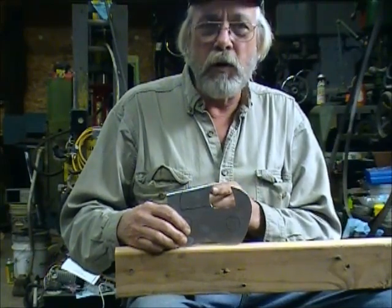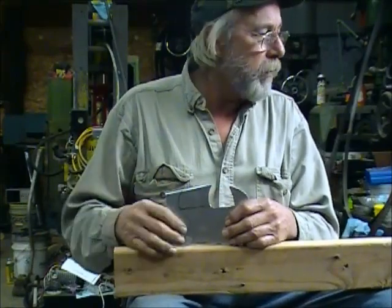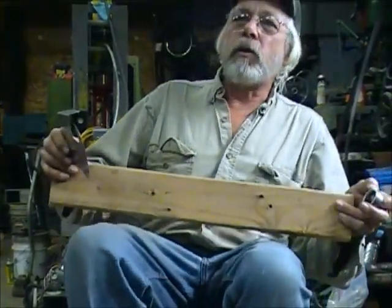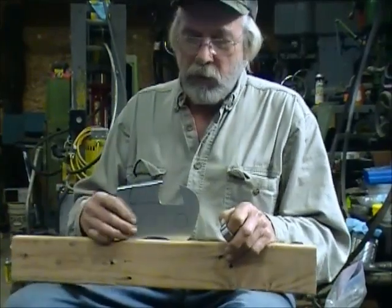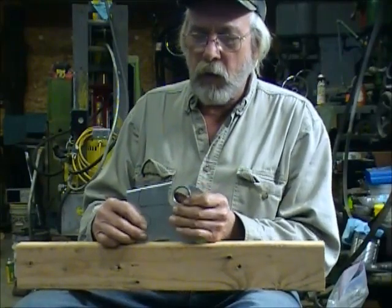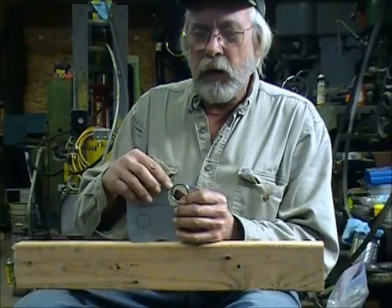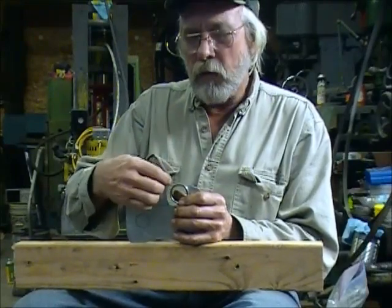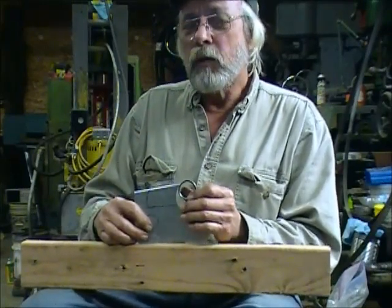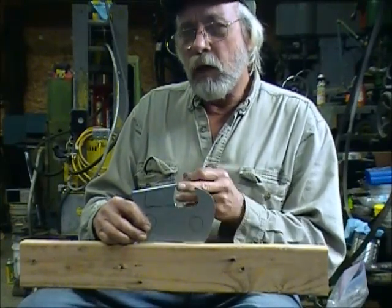This angle right here is so important to get right. And the angle this way when you grind the saw chain — when you're using a file and trying to file the chainsaw chain — the height of the side of this file right here is determining the angle of the tip of that cutter that's doing all the work. If you don't hold that file at the exact right height, you're not going to get the right angle on the edge of this cutter right here where it's doing all the work.